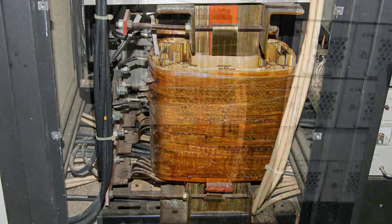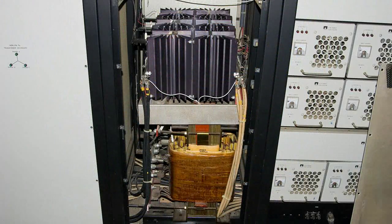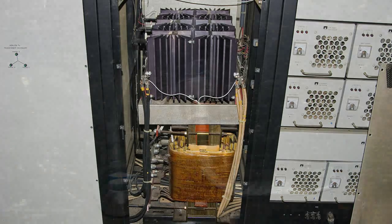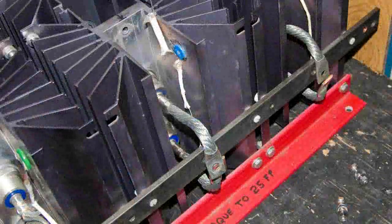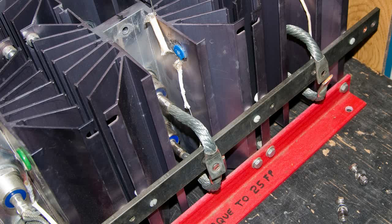Now what we have to do is remove the top portion of this power supply — the heat sinks and the 12 diodes. Here are a couple of spare diodes. We replaced four altogether. Now here the heat sink is on the table.